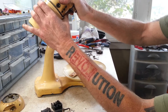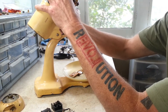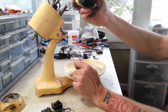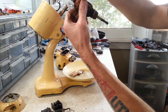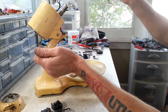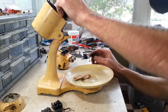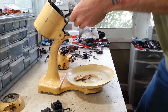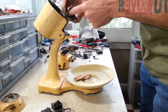You've got to be careful pulling this apart — a lot of times the leads pop right off going into your brush holders. Once you pop those off you should be able to pull the whole end off. Now pull the armature out. You can see it definitely needs some polishing but it really doesn't show any wear — it looks decent.